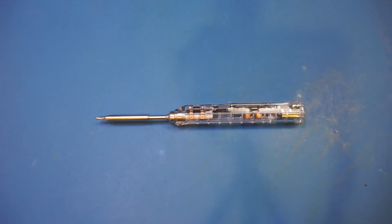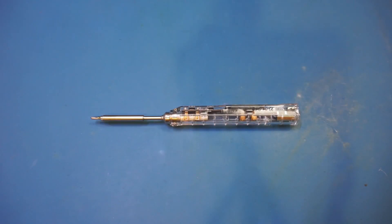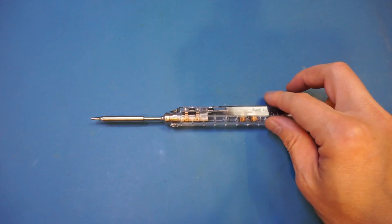By the way, the heating element is roughly 9 ohms. So the highest wattage you can achieve is around 70 watts if you use the maximum 25 volts supply voltage. You can see from this chart that using the supplied power adapter, which outputs 19 volts, you are only able to get around 45 watts. The time it takes to heat up the tip is also affected by the supplied voltage. The fastest heat-up time is achieved with the highest supply voltage, at just around 8 seconds. For our tests, I'm going to use a bench power supply so I can vary the output voltage and see how the soldering iron behaves under different voltages. First, I'm going to connect it at 25 volts so we can see how fast it heats up.